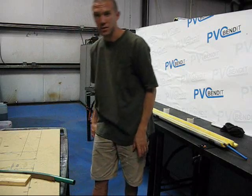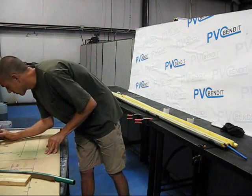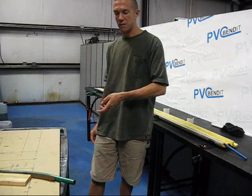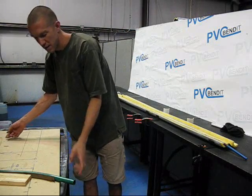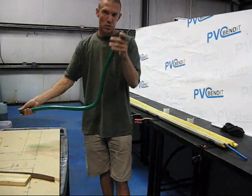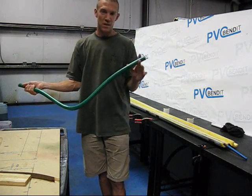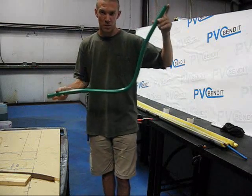The last thing I'll do, of course, is mark it for cutting. Just like the Build-A-Bend system, it's difficult enough to worry about the length of such a strange shape. And sometimes when you do a bend, you'll notice the end of the pipe gets a little bit messed up — that's just from taking it off the bender while it's so soft; it'll kind of rub up against it. If you cut these off and throw them away, what you're left with is perfect pieces and perfect edges.